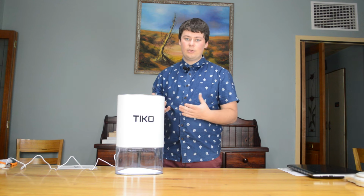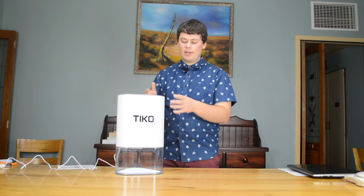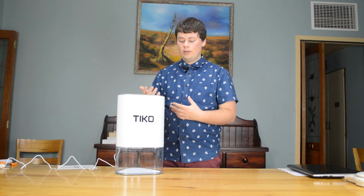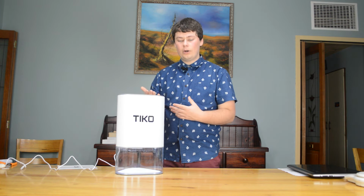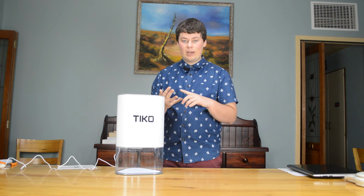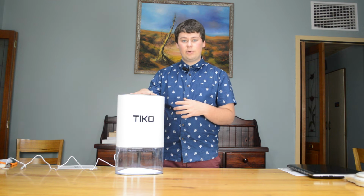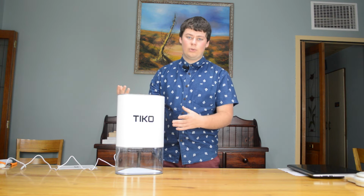The build volume is 125mm diameter by 125mm high, which is about the same as maybe an Up Mini. And the Up Mini is $800, whereas this is $180. So you get roughly the same build size. You can actually do a higher resolution on this than the Up Mini. You can change temperature on this machine, and it looks so good.